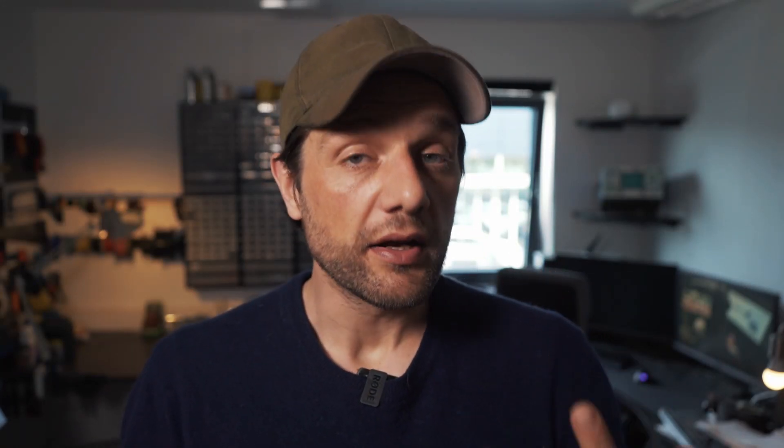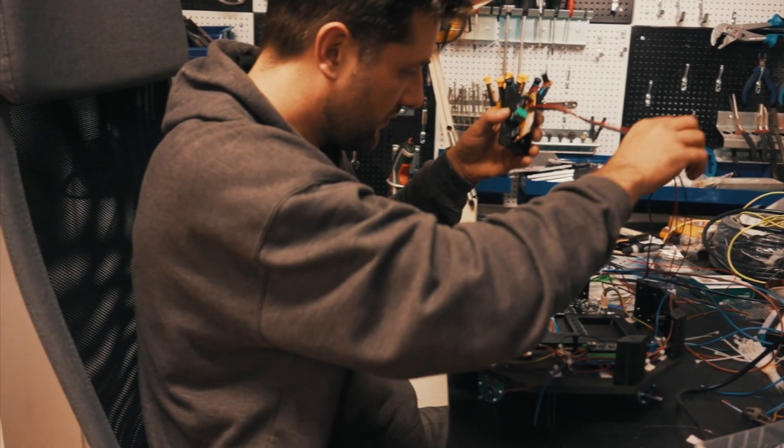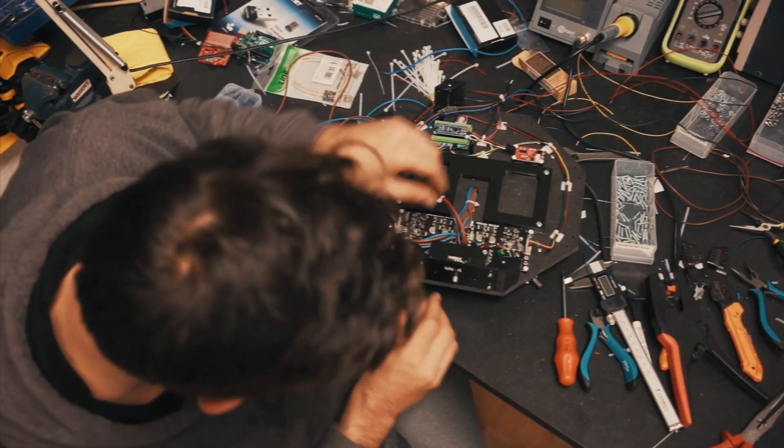Within the robot I have two Arduinos: an Arduino Nano and an Arduino Uno. The Arduino Uno is responsible for the whole communication to the operator as well as the communication inside the robot, whereas the Arduino Nano functions as a motor controller — it's only responsible for sending signals to the motors and gets its signals from the Arduino Uno, which is the master of the robot.